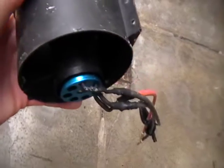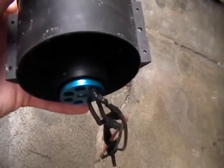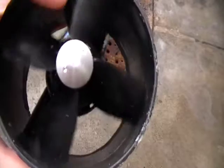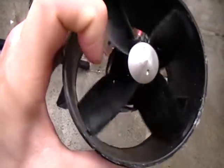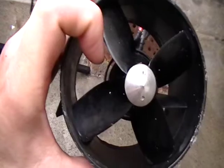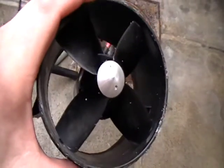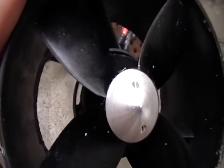Also, there's just no room at all for a heatsink on the motor. The HiMax motor comes with a heatsink which also kind of holds it squarely in place. The HiMax fan has the heatsink on the outside of the motor casing, built into the motor casing, which gets a good bit of air. You can see down through next to the motor housing — between the motor and the motor housing there's a good bit of room for cooling air to get in.